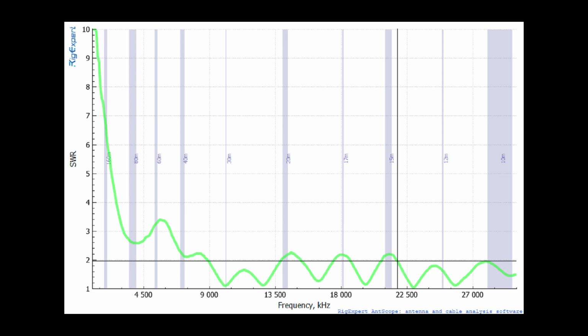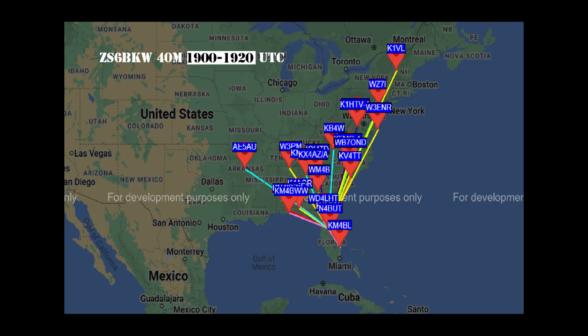Note that the dips in the sweep favor non-amateur spectrum, which, considering the marketed end user of this antenna, makes sense and further supports the idea that altering the length of the antenna may be a worthwhile experiment at some point, but the performance increases realized would not be profound in my opinion. On a side note, the auto tuner in my Pro 3 made short work of matching the antenna on 160 meters, but the observed terminal performance was awful.